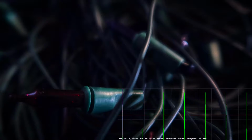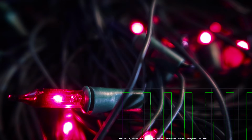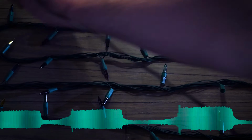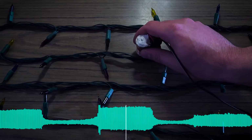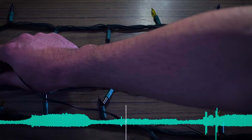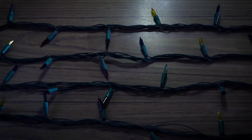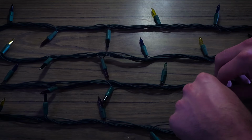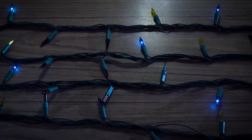Some of the lights were blown, and finding the blown ones is usually a time-consuming trial and error process, but now we have them under microcontroller command, we can make this a bit easier for ourselves. I connected a coil to an amplifier, and by applying a tone to the light channels, you can hear where the signal is broken. I used a 50% PWM signal for this, which for most pins is around 500 Hz. By tapping each globe, and when the signal disappears going to the previous globe and changing it, I fixed around 15 globes in about 5 minutes.